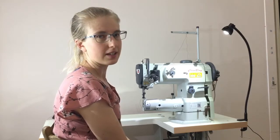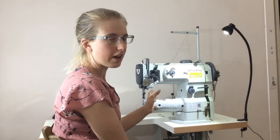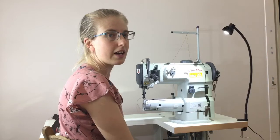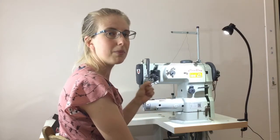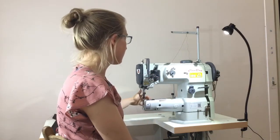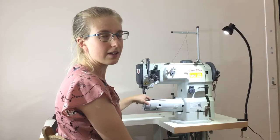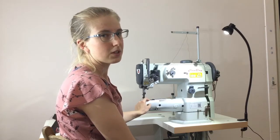I'm demonstrating on the Cowboy B6900. If you get some loose ends of threads or get some knots in the bobbin area, it's likely that the machine won't be able to wind over anymore, because even just the tiniest bit of thread that gets caught in here will jam it up. So I'll just show you how to fix that.